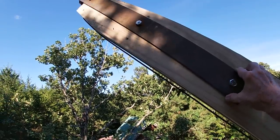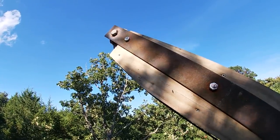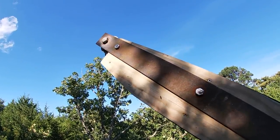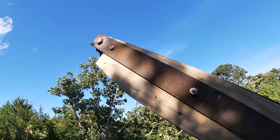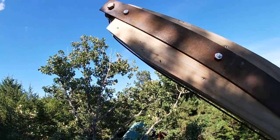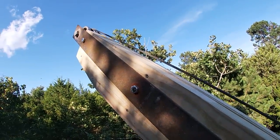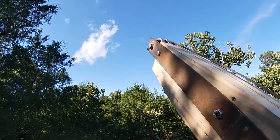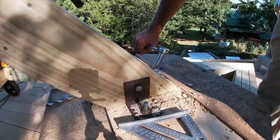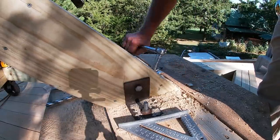At the top is quarter-inch, three-inch strap metal. I tilted it up just a little bit at the peak of the boom so the pulley — where the cable actually rides — will be up above the boom itself and not be cutting into it. It worked out pretty good: when the cable is hanging vertically it doesn't touch anything and doesn't ride too much on the top of the boom. It's ready now to put the counterbalance on, and then it'll be ready to lift up logs and set them on the wall.